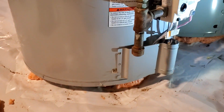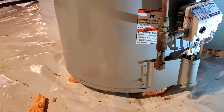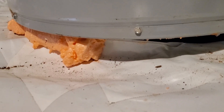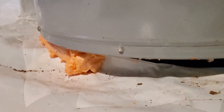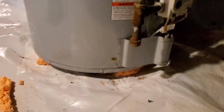People were saying, why is this going out all the time, why am I having issues — the water heaters are fairly new. Well, it's because you can see where they went up too high even with the plastic, and so it was blocking off all of the air that the water heater needed for proper combustion.